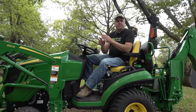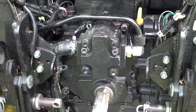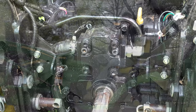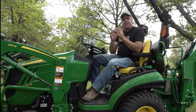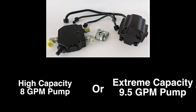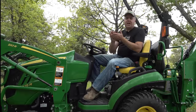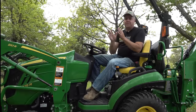The inventor has determined that we don't need quite as much flow for the steering, and instead we can divert that flow to help with the implement. So part one is essentially an adjustable flow divider. The second part of the solution, if you choose it, is an upgraded pump. It fits in the same compartment as the existing hydraulic pump — it's about three-quarters of an inch longer — and it's offered in two or three different ratings, all the way from 8 gallons per minute up to 9.5. There may even be a 12-gallon-per-minute solution at some point. This is asking a lot from a 1025R, but it's pretty exciting too. Remember, this will likely void your warranty, so it's something to consider.